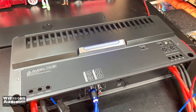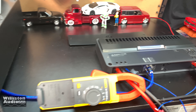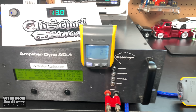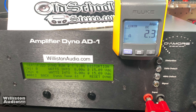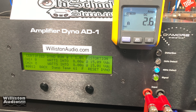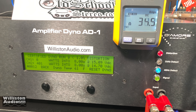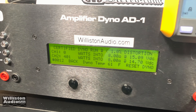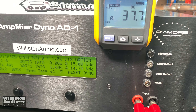I'm sure nobody would ever probably use this amp in an 8-ohm load, but I'm going to test it anyway because I'm just weird like that. Let's try certified 8 ohms mono for the RD1000 at 40 hertz. Still 400 watts at 8 ohms and 37 amps of current.